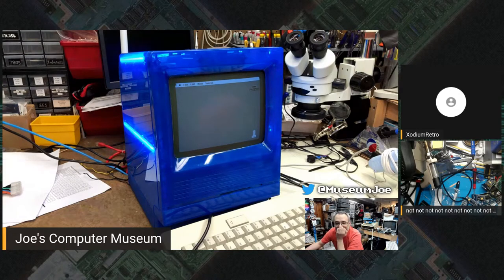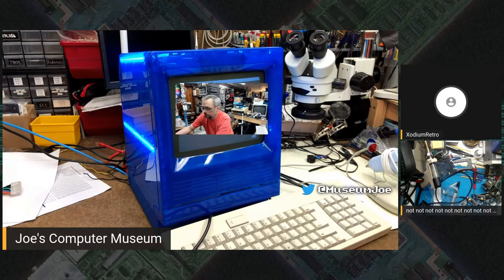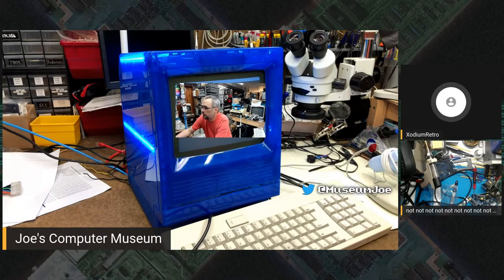So the Zulu SCSI, the current one, I don't have one in front of me, but it uses like an ST clone, I believe, right? I don't know what specifically it's trying to emulate or be like. I do know it's a GigaDevice thing because I was actually trying to roll through the motions of recovering, because I thought I bricked my Zulu SCSI when I was testing the 9600 fixes. I remember having to install the dev tools and stuff to potentially bring it back with DFU, but thankfully that was not the case.